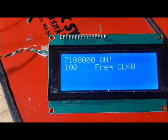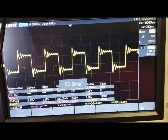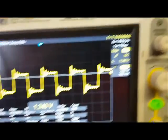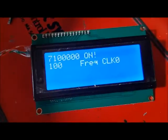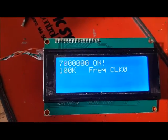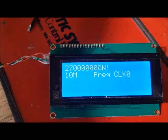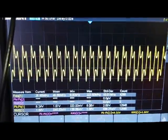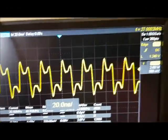It's on and it should be coming out at 7.1 megahertz. Looking at my scope and the frequency counter, it's reading 7.1 megahertz. I'm going to adjust this to go up — let's go up to 27 megahertz. It looks a bit gnarly because the probe has a lot of capacitance and isn't really terminated.